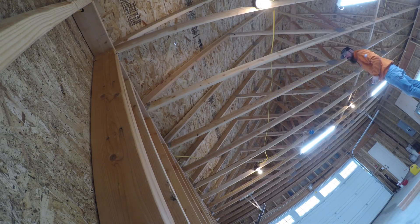What I was doing there is measuring an eight-foot standard because the two-by-fours in the glue-lam up here are eight feet long. I'm going to nail some supports on the bottom of this truss so that when I get ready to make my glue-lam, I can just rest my two-by-fours up on that.